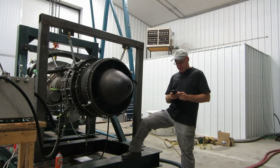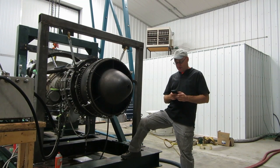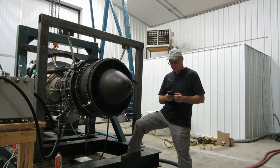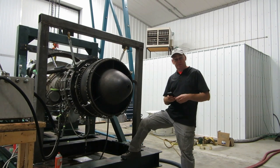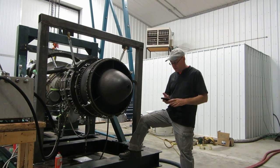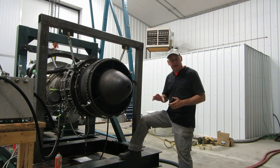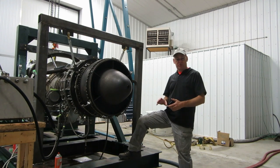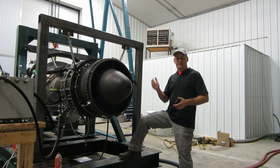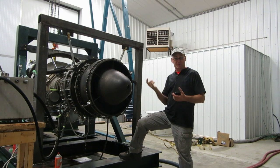Question three is by Rowan Berry Nice. He asks: you explained how the thrust of a powerboat turbine is nullified by a divergent nozzle, but is this also how helicopter turbines have their thrust nullified? Well yes, because a powerboat turbine engine is just a helicopter engine. Helicopters have a special nozzle to eliminate any residual thrust left over in the exhaust gases, because nothing's perfect. The power turbine takes out 95% of the power and turns it into torque on the shaft, which drives the rotor and tail rotor.